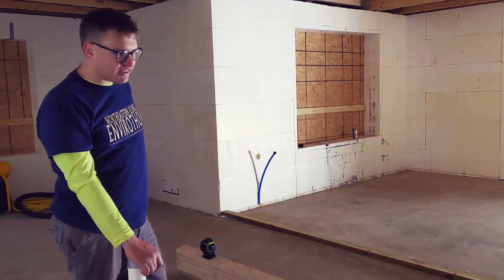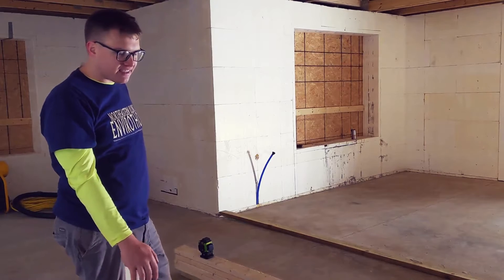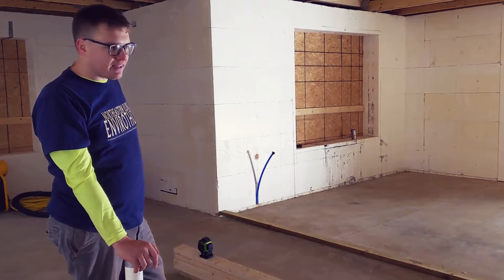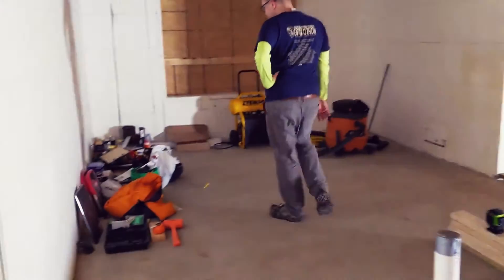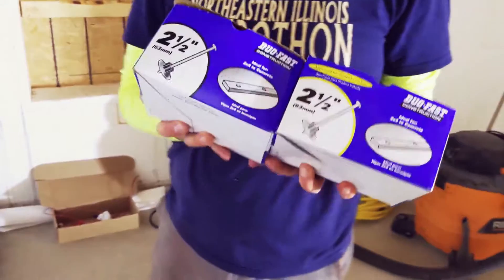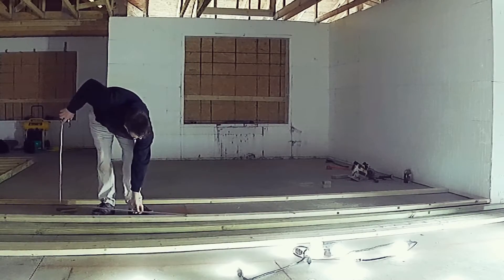There are actually pressure-treatment-rated ram sets and non-pressure-treatment-rated ram sets. Considering they're both for going into concrete, I don't know why they wouldn't all just be galvanized. I got the wrong ones the first time — I can show you the boxes, they're deceptively similar. I got two-and-a-half inch originally, but you actually need the one that says approved for treated lumber. These are the galvanized ones.